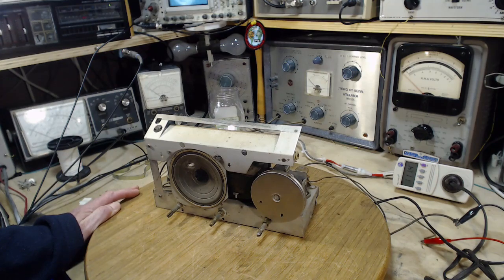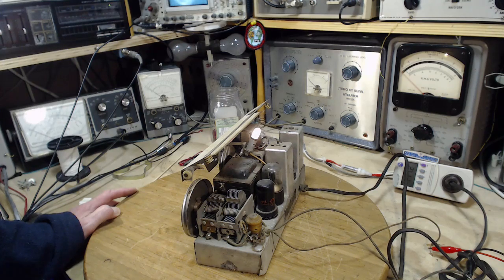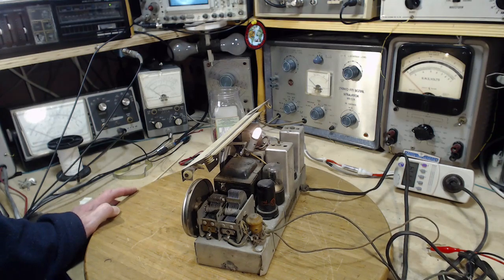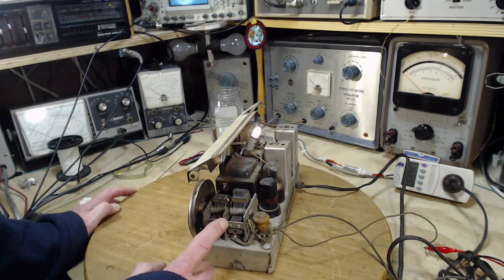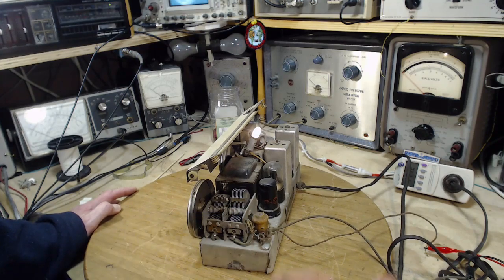Either this is a much finer radio, or what? It has no RF tube at the front. Goes straight into the mixer, just like the other radios. Has no loop antenna. It has just a wire antenna, although I have to admit, as wire antennas go, this is probably a pretty good one for somebody in the house. Oh my gosh, the bent plates here tell me that somebody, probably in the factory, took some effort to really properly align this radio right across its band.